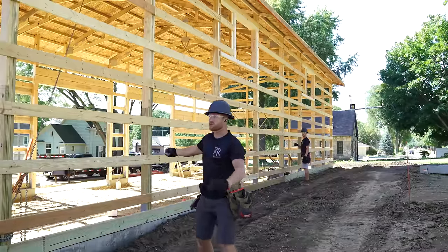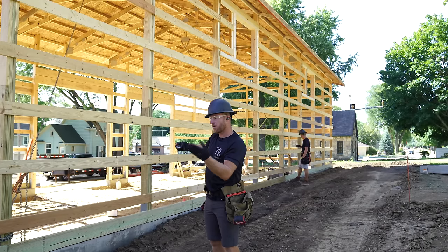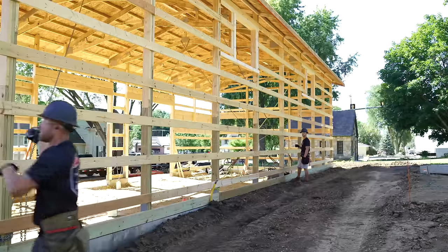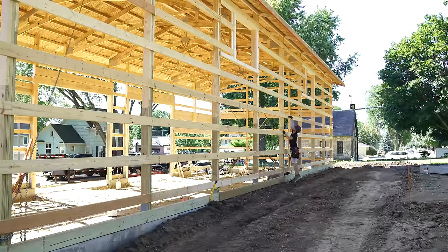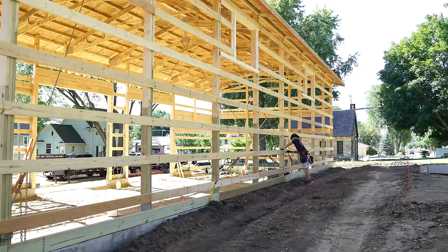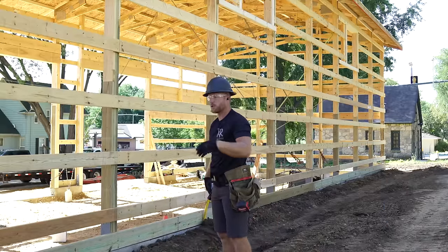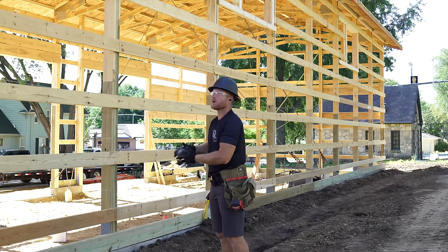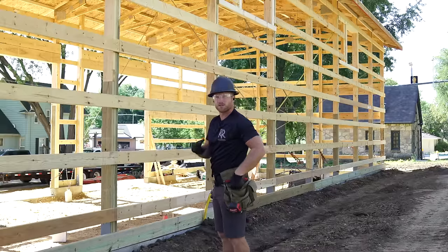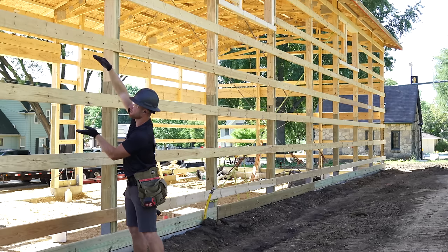What we're doing right now is getting all of our reference lines because there's going to be a stagger joint and we're going to be running our sheets vertically, which means we won't have a consistent single line to go off of because we can't snap on our foundation. We used our soffit nailer as our consistent point because the foundation had some variances. We're going to mark from the soffit down and now that we have these two lines established we can use them to get measurements so we can cut the pieces for the bottom — a four-foot piece and then an eight-foot piece going the whole way down.